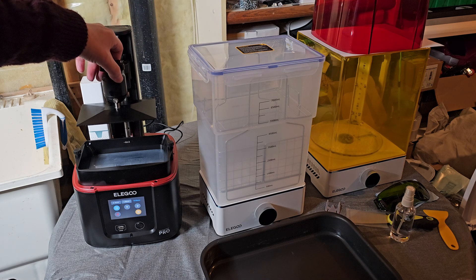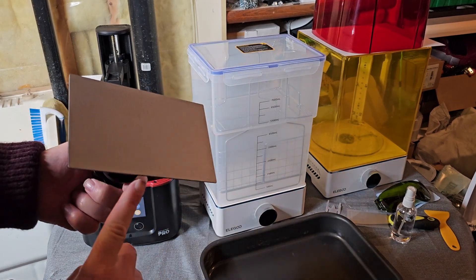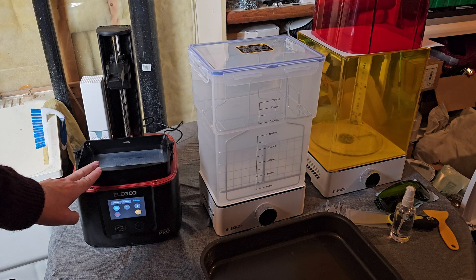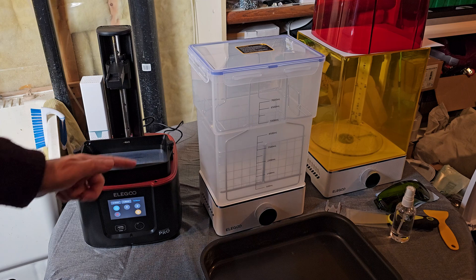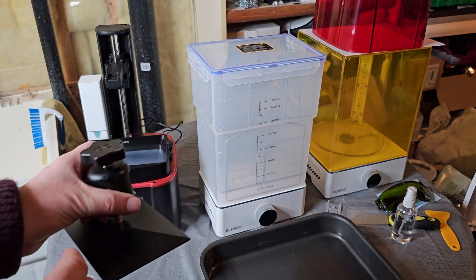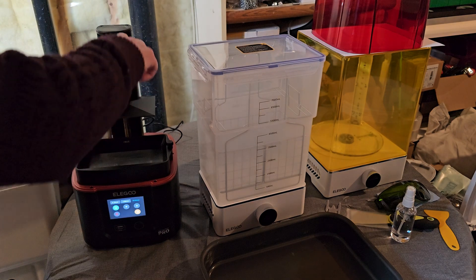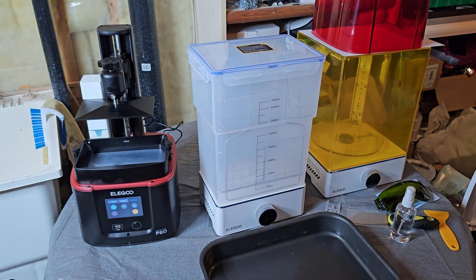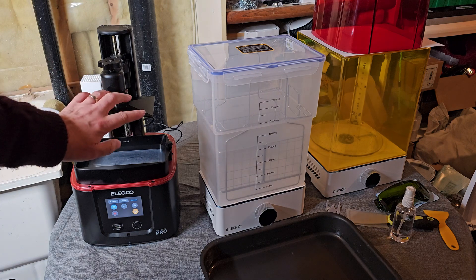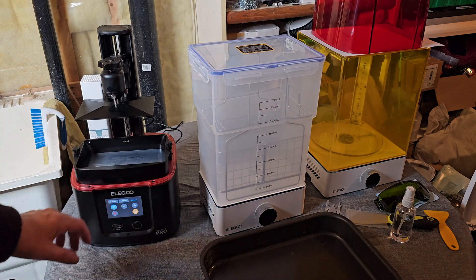You'll be doing this — fastening the plate on and off — multiple times. This is your build plate. There is plastic on it when you first get it; make sure you take that off. Slide it in until it doesn't go any further, then tighten it down. That's the first step. Now they give you Allen keys — you're going to loosen this screw first, then the next one, which will make the plate loose, and then we're going to do the leveling.